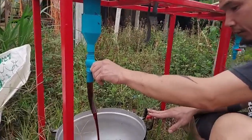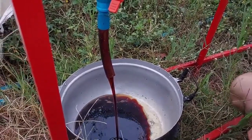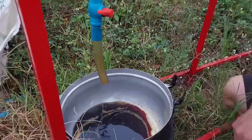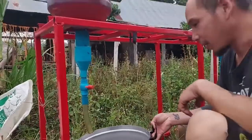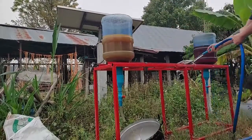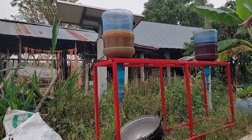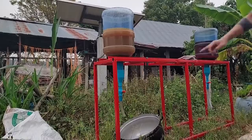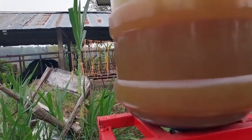The glycerin comes out like a sticky muddy black stuff. When the liquid coming out turns more clear, that means all the glycerin is finished, so we turn off the valve quickly so we don't waste biodiesel. After that, we wash it with water from the hose — we add a lot of water in there. This washes out the leftover glycerin mixed in the biodiesel. We let it sit for another few days, the glycerin settles again, and then we drain it and wash again the same way.